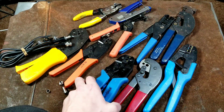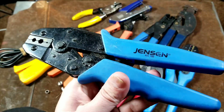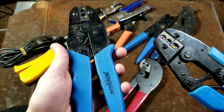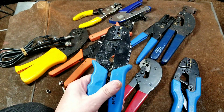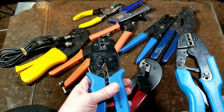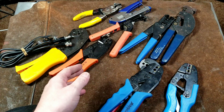These work pretty well and have solid jaws. They're actually pretty heavy but not the easiest thing to use. I did do a review of the Ideal Crimp Masters — they were actually Jensen crimpers into which I had put different dies. The reason I did that was because these dies in this style are what Harbor Freight carries when you search for ratcheting wire terminal crimpers. Crimper dies usually have to be the same brand — Amp dies can be interchanged with Amp tools, but not with Ideal, Quest, or Jensen tools and vice versa.